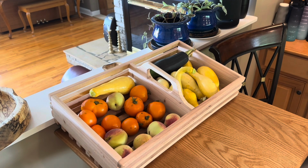I made this out of a cedar fence picket. I didn't pay attention to how many it would take. I was using up all my scraps, I'm sorry. But you know how cheap they are. And some glue and some 1 1/4 brad nails. Don't nail it to your bench like I did. But other than that, it's a pretty simple build. Probably if I wasn't filming it, it would have taken me an hour to an hour and a half.